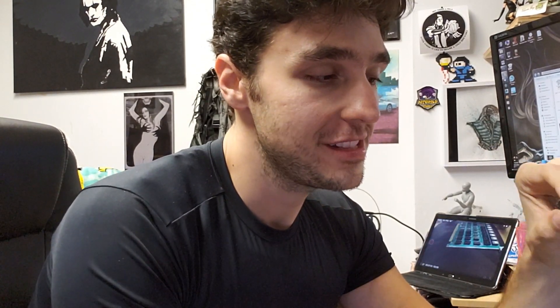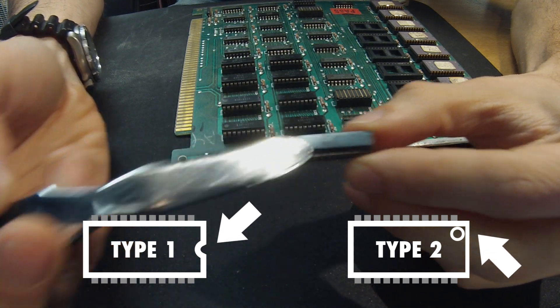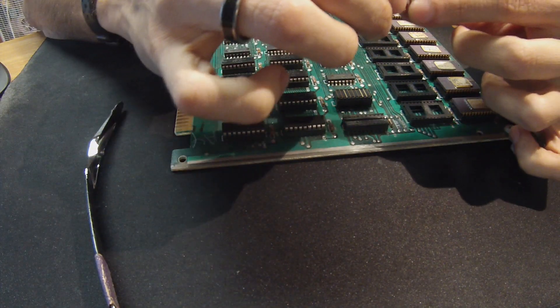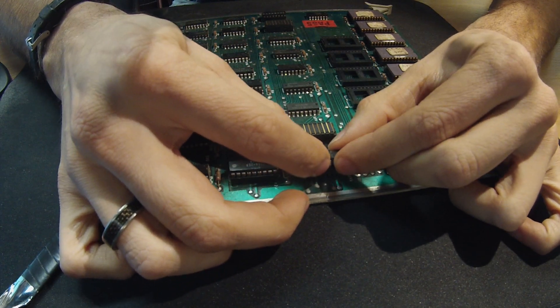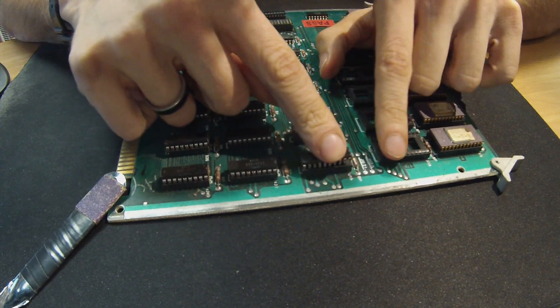What is very important is that it goes back in the same way that we took it out. Fortunately, this chip has both tricks to remind you which way you took it out: towards my fingers there's a little notch and a little dot. Some chips just have the notch, some chips have the dot — they're only on the one side. You can check out the rest of the chips on this board; they're all facing the same direction, all the notches are to my left. So that's how I'm going to put this back in — slowly ease it in to make sure that all of the legs are going where they need to go, because they're very fragile. Do not bend the legs, because they will eventually break.